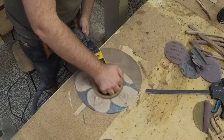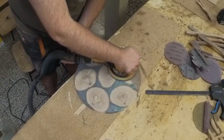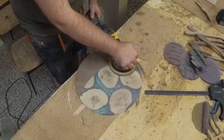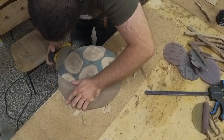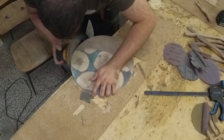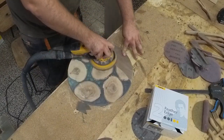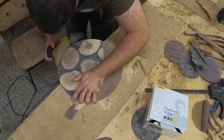And 240. Next I move on to the Mirka sander. With the Mirka sander I usually step down one or two grits, so here I did start with 100 sandpaper, then go up to 150 and 240. If the item is made just from wood I stop at 240, but since there's epoxy here I go up to 320, 500, 800, and the last one is 1000.